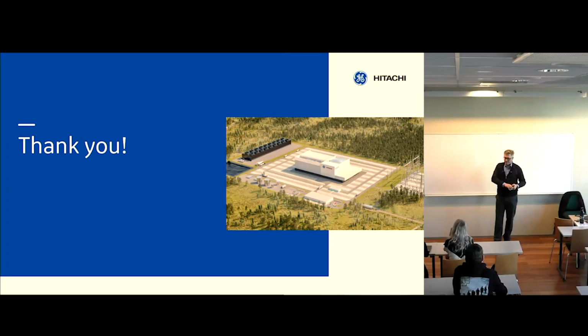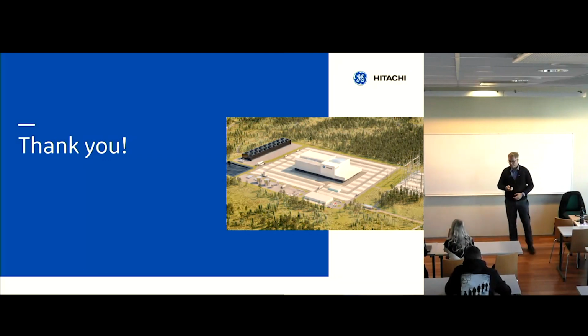Now, if we have hydrogen, it won't be as a result of a Fukushima event, but it could be something else. It would then collect in the reactor building because we vent the containment in that kind of event to the refuel building, to the refueling area, and we're putting passive autocatalytic recombiners in that area.